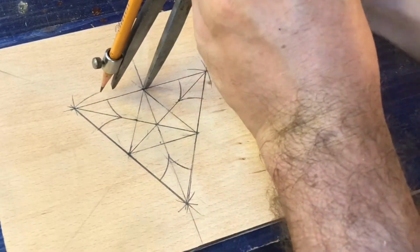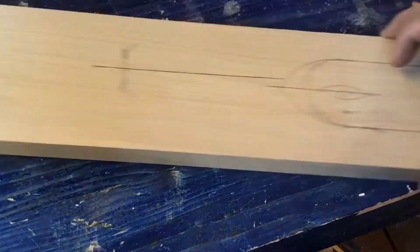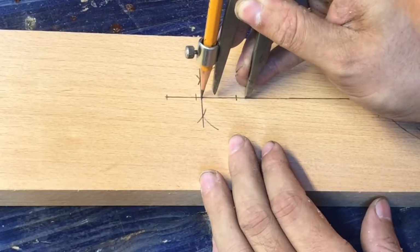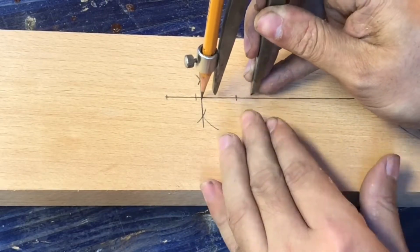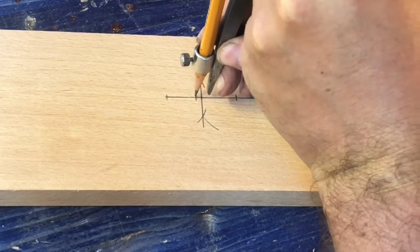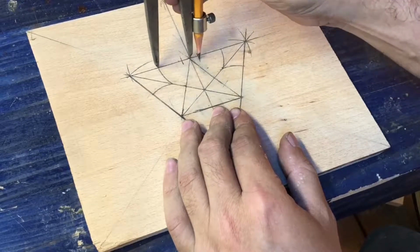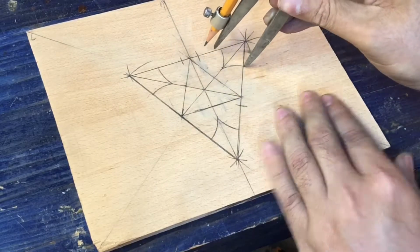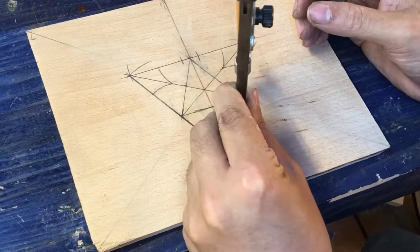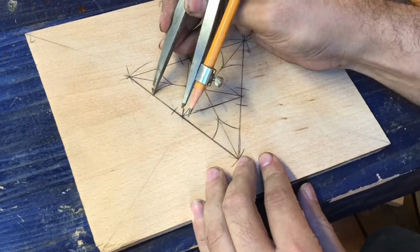So I'm going to set my compass to the point on my map. Then I'm going to use my little measurement that I made and go 1 increment bigger. I set my pencil on the intersection, stick in my compass, and move it up my increment. Now it's 2 increments bigger. Then I put those marks on my outside line, and it's from these marks that I'll be making my little pointed arch. They are off-centered by the same amount, so they'll meet in the center. The point will be in the center.